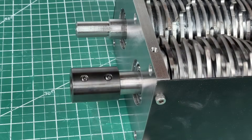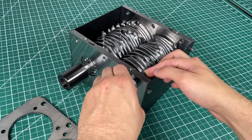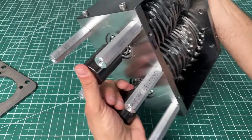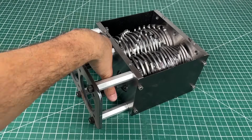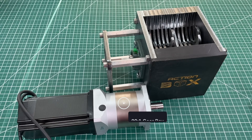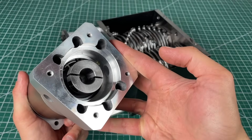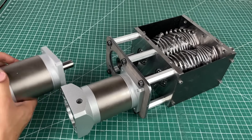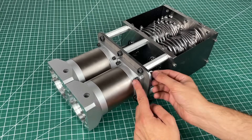At this point you can attach any power mechanism you want. We cut out a custom yet simple design that bolts onto the frame very easily — just push the 3/8 by 16 bolts in from the inside of Shreddy and thread on the McMaster standoffs. Once we got all six on there, we screwed the motor plate on. Similar to Shreddy 2.0's stepper motor and 80-to-1 planetary gearbox, we used a 250-to-1 planetary gearbox to really increase the torque. We pushed the gearbox into the coupler, tightened it down, and installed the second gearbox — another major upgrade from V2 — then bolted them both into the motor plate with M5 screws.